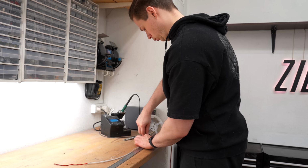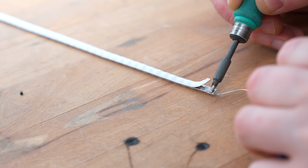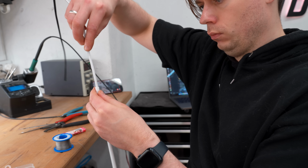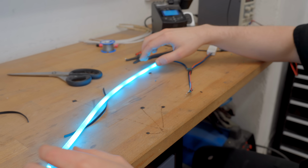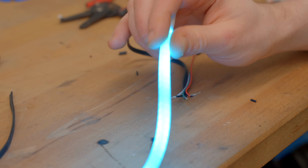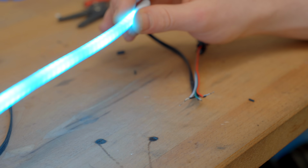Finally, the whole reason why I wanted to build this thing. The lights. I'll be using the densest and the narrowest addressable LEDs that I could find. Since the tubes are just so small, to get that full 360 wraparound glow with no shadows, I need to put 2 strips back to back. So the power consumption of course is doubled, but so is the brightness. I offset the strips a little bit so the hotspots form this snake scale pattern when looking from the side.